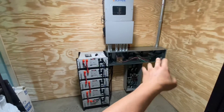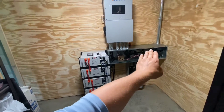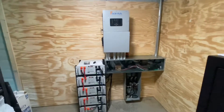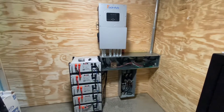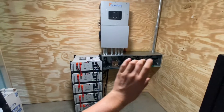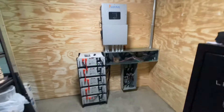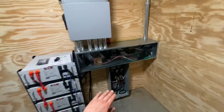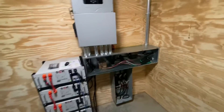Six feet of wall space with a four-foot wire way and transfer switch on the bottom, but you would have a very busy wire way, so make sure you plan it out. Most of the systems we do with a double stack use a much longer wire way, but we could make it work — I'd probably move the PV conductors and install another power distribution block to combine them.